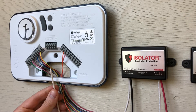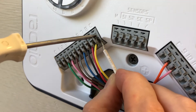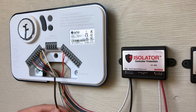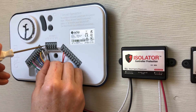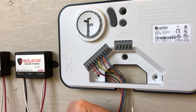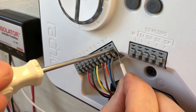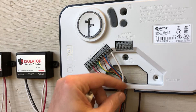Let's start by connecting the white wire of the black and white pair — it's going to install in one of the common terminals. The Rachios have a couple to choose from and are connected internally, so any of them will work for your install. The black wire of the black and white pair is going to install in the master valve terminal; this will provide the signal to the isolator once the controller has started. Let's go ahead and do the same install for our second controller — white will connect to the common and black connects to our master valve terminal. Note that we're still using the master valve terminal even though we're not actually using a master valve. This terminal provides the isolator with a signal to let it know when the controller is on and needs to water.